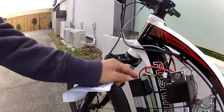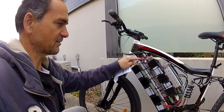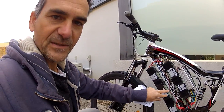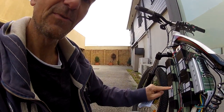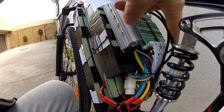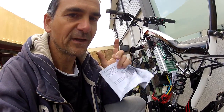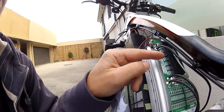To get all the battery packs running in parallel balance, I've put parallel balance plugs from each of the opposite two cells. I've got five sets of balance plugs coming out, each with about five wires. When wiring in series, the last wire of one pack and the first wire of the next aren't both required. You end up with 20 wires on the BMS, going from negative all the way through to 84 volts. Before connecting, make sure each step reads 4.2 volts or 3.8 volts — whatever the batteries are at — otherwise the BMS won't work properly. This BMS also has over-temperature protection, which works well in a closed environment.